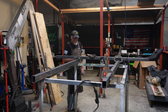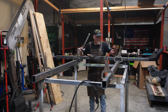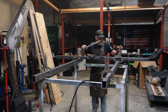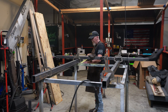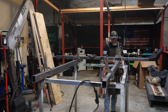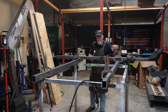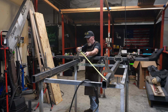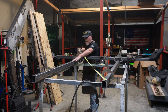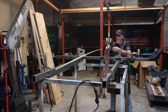The easiest way to get these straight is to put them on here and mount them up to your brackets kind of lightly. The way I do it is I measure 12 inches off of the end of my cart on both rails, clamp them down real good, and then make sure that they're square. You do that by measuring diagonally from end to end. These frame rails are 81 inches long, so diagonally with a 33-inch split, they should measure 89 inches diagonally on both sides in both directions.